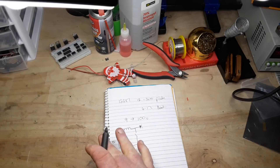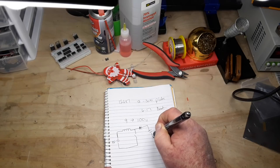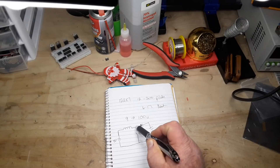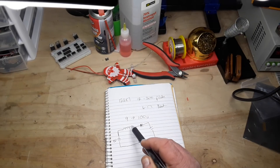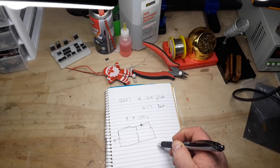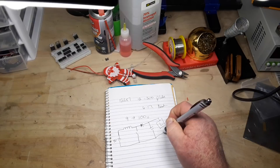So this is the other half of our boost converter. We put a diode here — what's called a flyback diode — basically to keep that current and voltage from going backwards. And we have it flow through a capacitor. When the switch is closed, current flows and charges up the inductor. When the switch is open, that magnetic field collapses and since it can't flow back through the switch, it flows through the diode and charges up the capacitor. Then in parallel with the capacitor we'll have our load.